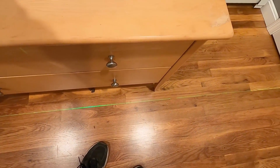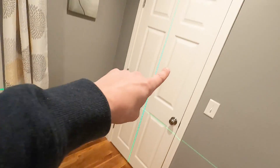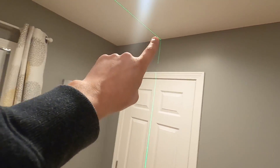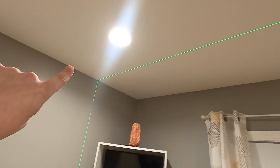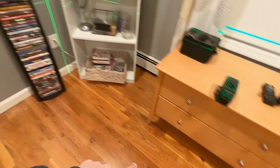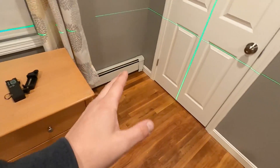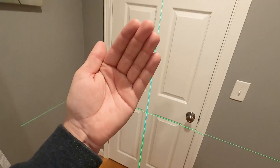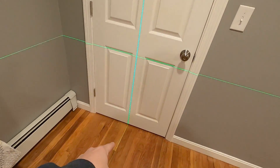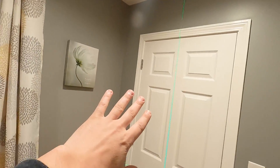Say you want to square it like that — now you can just build a wall right here. There's your plumb studs. There's your top plate all the way across here. Plumb the stud and the bottom plate. That's super handy. That way you don't have to mess with a four-foot level with a stud trying to get this line to be plumb up here. That's just awesome.